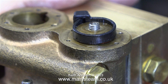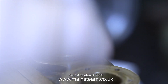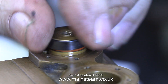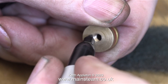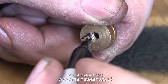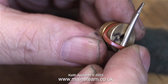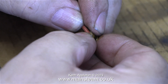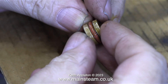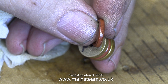In this clip I'm reusing the cable tie to remove the second piston. You can also use this cable tie method to compress cast iron piston rings. In no time at all the piston is now in my hand rather than on the piston rod. In exactly the same way as with the previous piston, once I'd got it off the rod I wrote on the end of it — this time putting a letter R for right. I'm now removing the old piston ring, discarding it, and fitting the new one. First I put some steam oil in the groove. A word of caution: always use steam oil on silicone rubber because it doesn't attack it — some oils with additives can attack silicone.